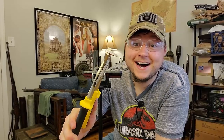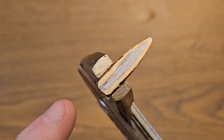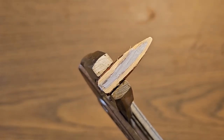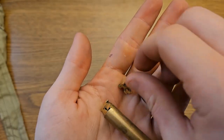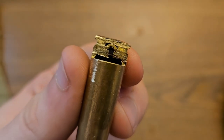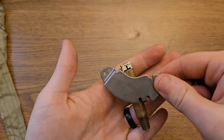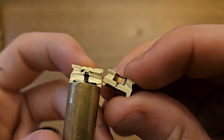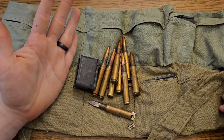Just out of curiosity, we'll take a look at the cross section of this bullet with the grinder. It has a pretty thick jacket with a pretty small core. The jacket is a copper-zinc alloy and the core should be solid lead. I've also pre-cut the case head — the cross section shows a single flash hole, meaning these are boxer primers as advertised, making this ammo reloadable — a huge factor for a lot of 30-06 shooters. The cases are completely non-magnetic because they are brass.